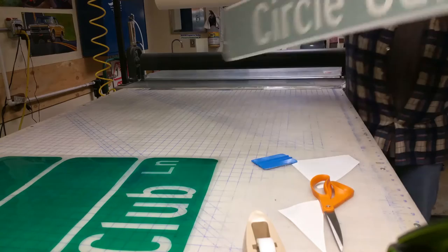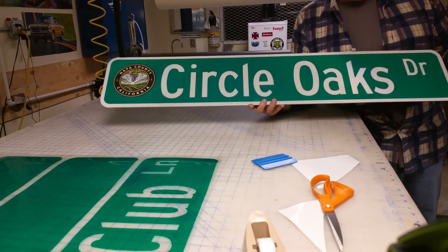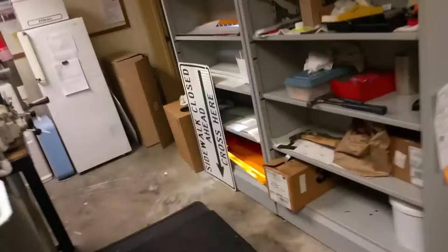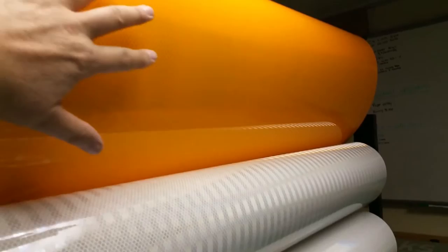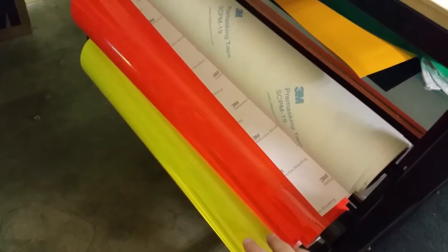So basically that's a street sign from Napa County. To make the other signs it's the same principle — you use yellow sheeting for warning signs with black EC film. We've made our own design on our table to lay out the signs. I've got the nice table here to work with, and the different rolls of EC films — this is diamond grade high intensity prismatic, another diamond grade yellow, transfer tape dispensers, graffiti guard film, orange for construction signs, and school zone signs.